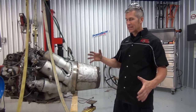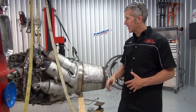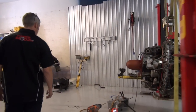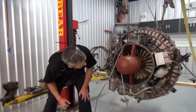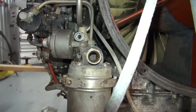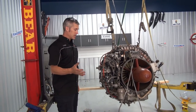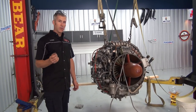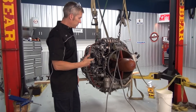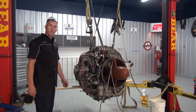So we're gonna have a container with my jet fuel in it, or my kerosene, and we're gonna bring it up to about 15 PSI inside the tank. That way it's gonna flow enough into the fuel inlet here. I'll show you that. It's about the same size as a garden hose. So that's where it's gotta go in. That's my fuel inlet. I can get pumps that supply 15 PSI, which is the max PSI you need, but they don't flow the right amount of gallons per minute or liters per minute. So we're just gonna compress our tank to 15 pounds. We'll constantly get as much as we need. And that's it. Now, let's build that frame, Jamie.